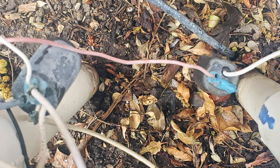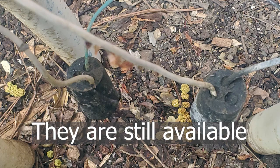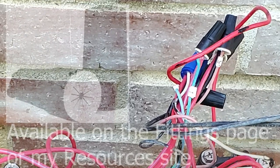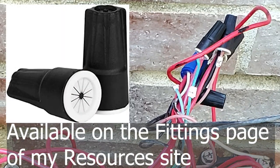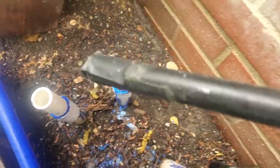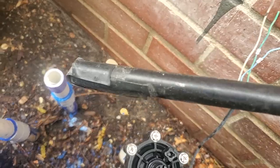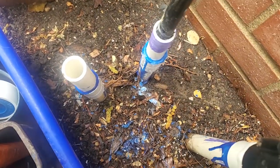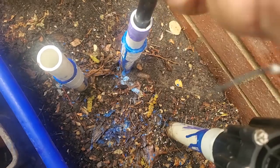The wire connectors used here were popular back when these valves were installed, but they're pretty obsolete now. Most folks are using these watertight wire nuts that have gel in them. Water is seeping out of here so I've got my drip tubing with electrical tape on the bottom to displace that water.